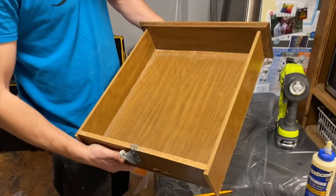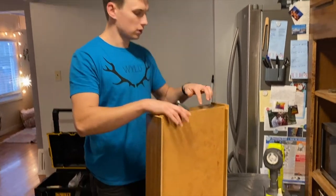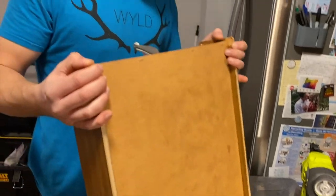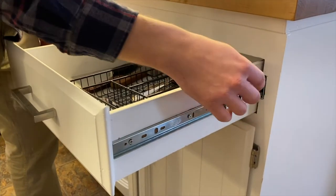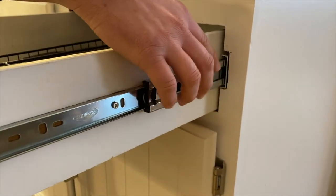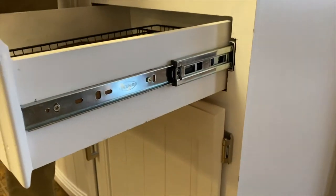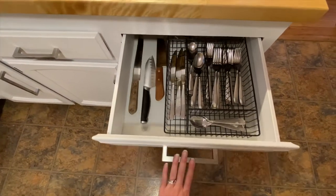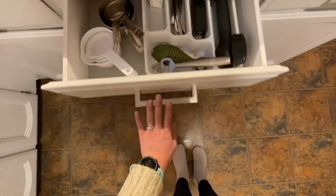So what I'm going to do is square this up again, push this sheet back into its groove, and on the back as well, and then put glue and pin nail it all in. You can revive these things that are kind of dying right in front of you. Before I added the slides, there was no room, so I cut in enough space to add them, then put plywood going along the length so I could screw the slides in. You have to reconfigure the inside to fit those slides, but I think it's worth the time.